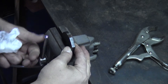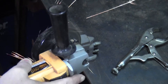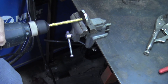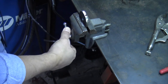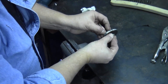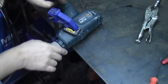So I want to get it closer to a round shape. I'm going to start with the angle grinder by mounting the piece in the vise — this is just getting the rough edges off. The preferred tool for this job would be a metal cutting lathe, but mine's not working right now, so I'm going to have to find another way. This is a three eighths — or roughly 10 millimeter — hole, and I'm using a mandrel here to hold it, which will allow me to spin it in the drill and get it circular.